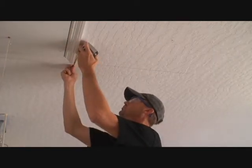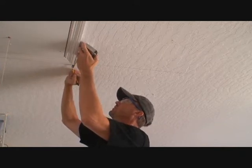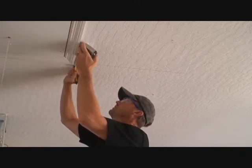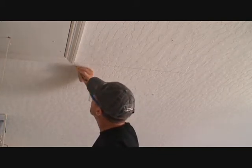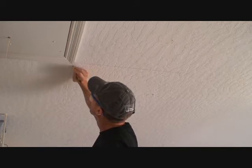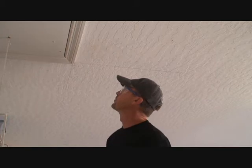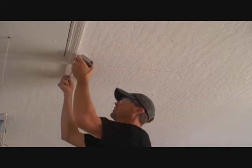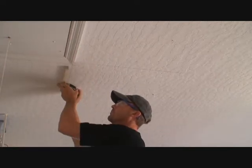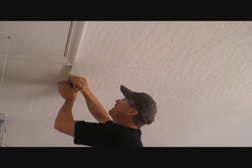So now I'm going to come over 1 inch to allow a little bit of clearance. Maybe I'll go 1.5 inches. And that will be the center line, or the center for my first hole. The other hole is going to be 4 5/16 over from the first hole, which would be right here.